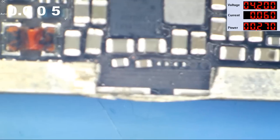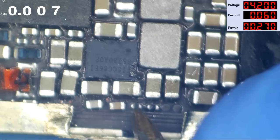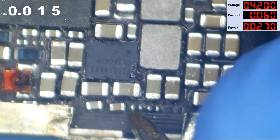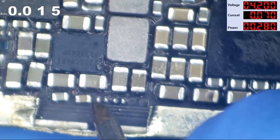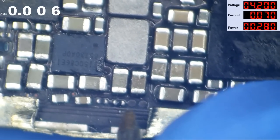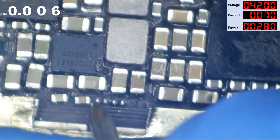I want to find a faulty I2C line — like, come on, please send me one with a bad I2C line with a short on it. In DC volts mode, we're still looping: 80 milliamps dead, 80 milliamps dead. I'm getting nothing for DC volts on this I2C line — zero. On the other I2C line I'm getting 1.8 volts. So this I2C line reads 1.8, this one over here: diddly squat.